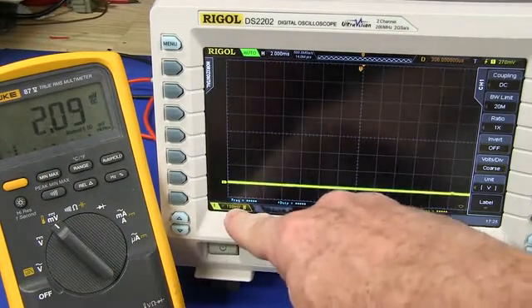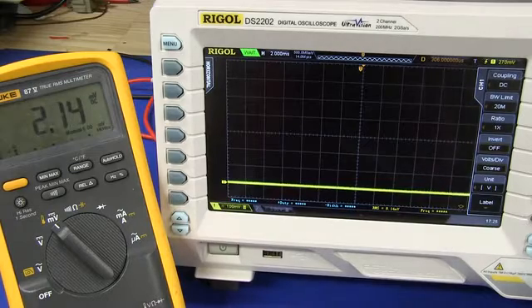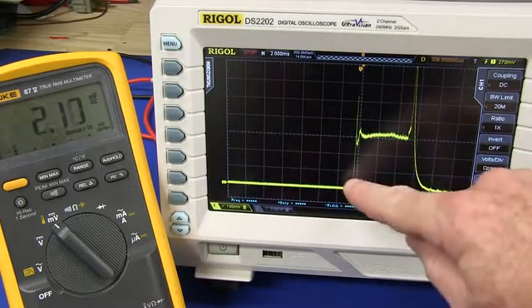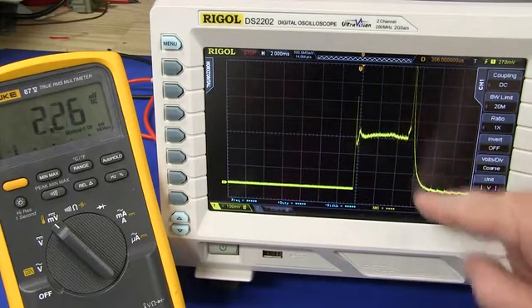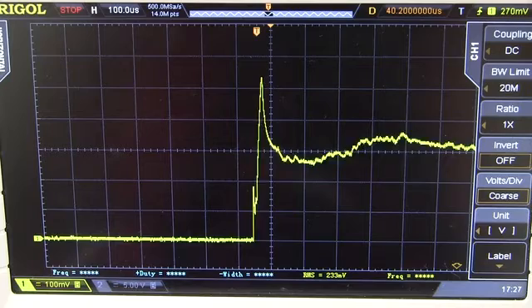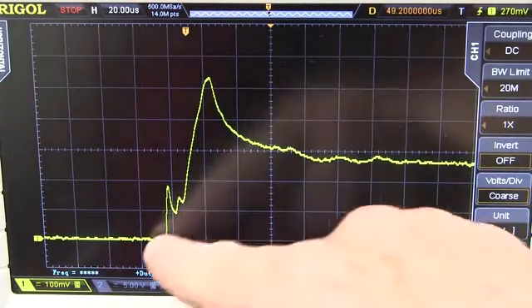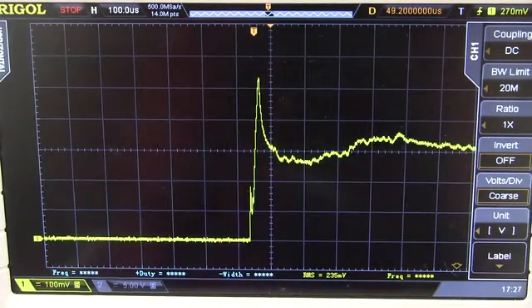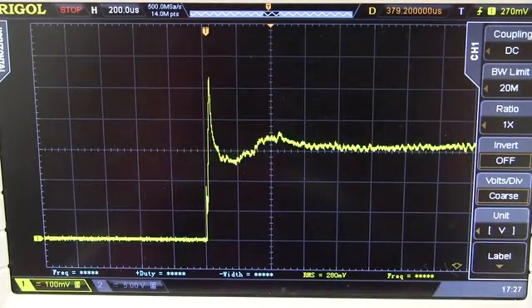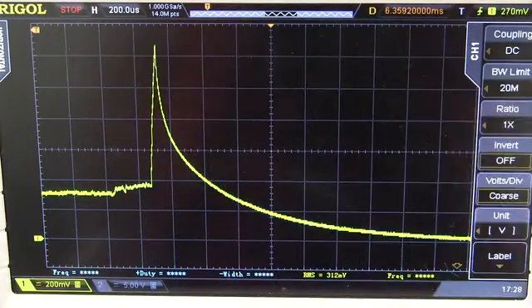If we run the scope at real time with 100 millivolts per division — or 100 microamps per division — boom! You can see we're capturing something. Go to single shot mode and bingo! We've captured the pulse where the microcontroller switches on from that 2.1 microamps up to about 300 microamps, then shuts back down and goes to sleep. That's where it's updating the screen. We can zoom in and look at the detail afforded by the 300 kHz bandwidth of the MicroCurrent. You can see the current start up, some serious overshoot, then it dips back down and goes back up. And where the microcontroller switches off, the current shoots up to almost 650 microamps and then tapers off back down to 2.1 microamps.